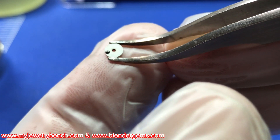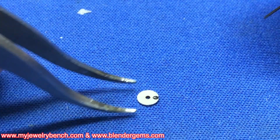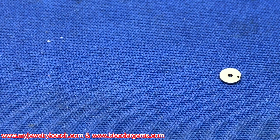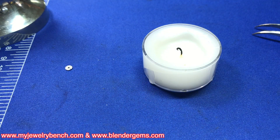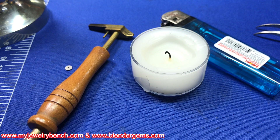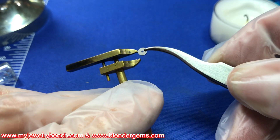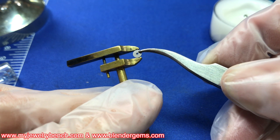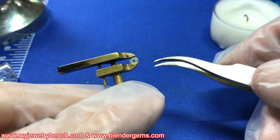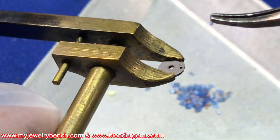Now's a good time to take a look at the roller table — you can see we've got a little bit of glue in here. Some people will use shellac like I do; other people will use adhesives, which is fine. I sometimes use UV glue on more modern watches, but the only problem is you don't get a lot of working time to set your jewel in place while the glue is warm, because the light will solidify it. To do this particular repair you're also going to need a candle, your roller table warmer, a lighter, and your assortment of roller jewels.